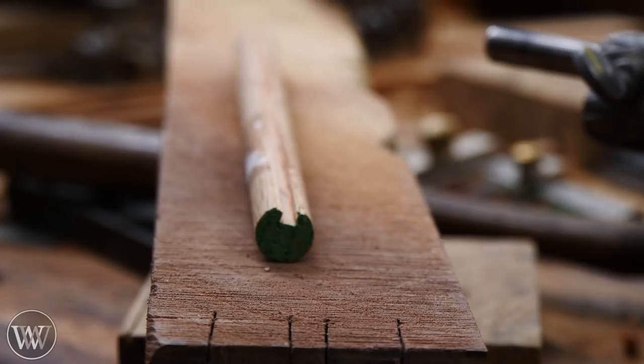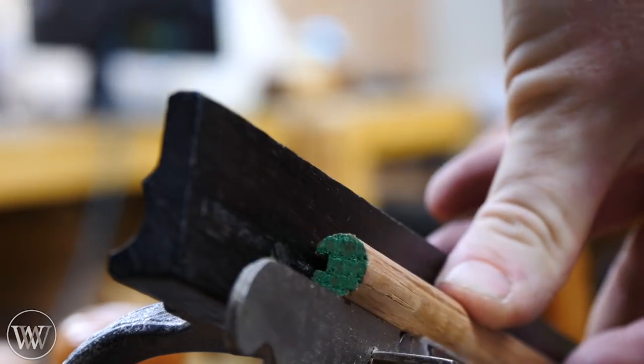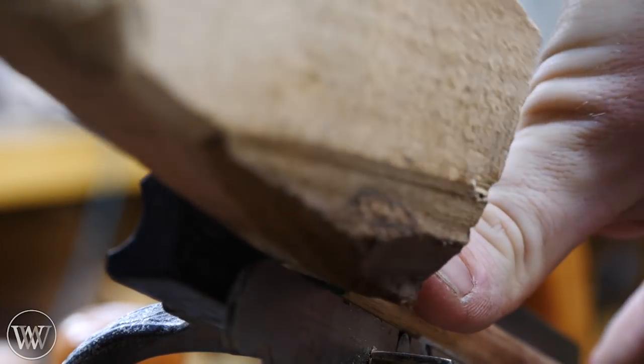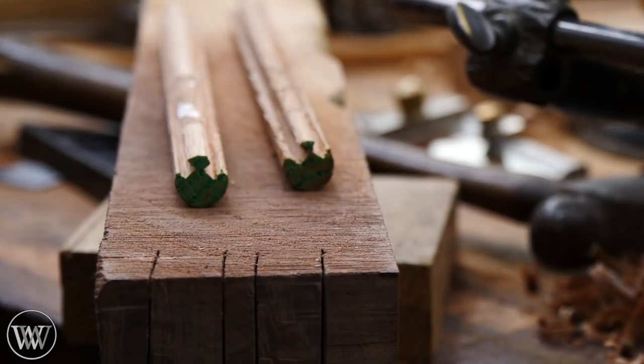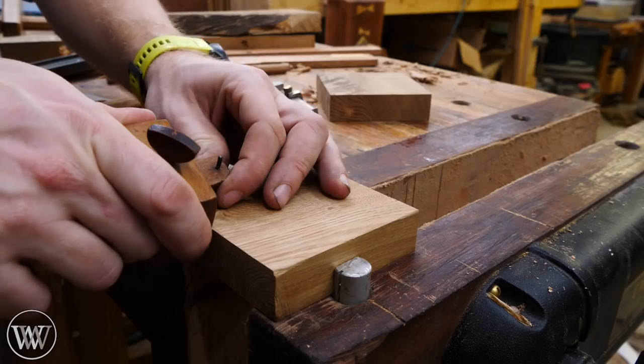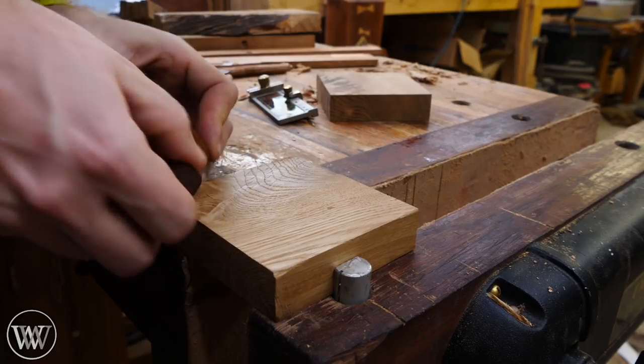But now I need to cut another one at 90 degrees. I thought this was going to be a huge pain — how do you make sure it's at 90 degrees? Well, the first groove actually references off the fence and holds it at 90 degrees, making it very quick and easy. I was just really blown away at how simple it was to cut these. Were they perfect? No. Do they need to be perfect? No. They ended up working very well and were very functional.